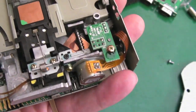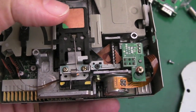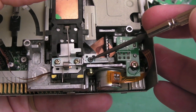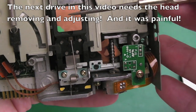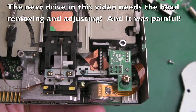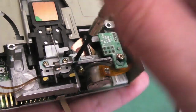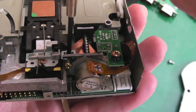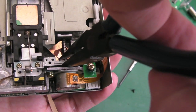The question now becomes how on earth do you get that out of there? I think the answer might be to remove that little screw there carefully - not these ones, don't touch those, that's to do with the head alignment. If you do that you're in a whole world of hurt trying to get the top head realigned with the bottom head. You need some special software and a scope - a scope and some sort of calibrated test disk. But if we just remove that little screw holding that post... this is the first time I've ever had to remove that little bracket, actually.